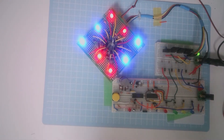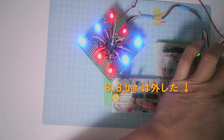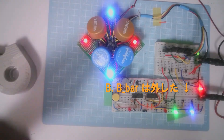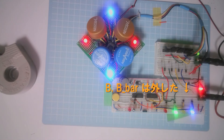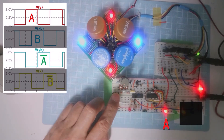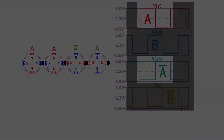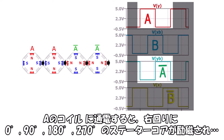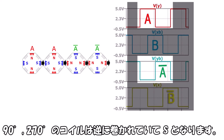I switch to manual input and send one clock at a time. I disconnect B and B-bar so they are not energized, to investigate the polarity of coils A and A-bar. B and B-bar sensors are masked since they retain their last state. Focusing only on A (red LED) and A-bar (green LED) on the drive circuit: when coil A is energized, stator cores at 0°, 90°, 180°, and 270° are excited — 0° and 180° become N, while 90° and 270° are wound in reverse and become S.